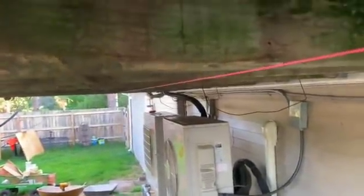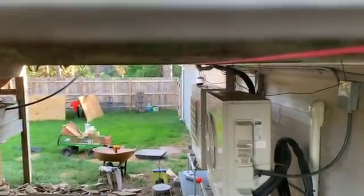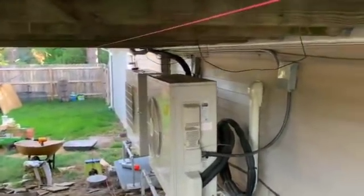It's exactly 32 inches from this string to the house. I stretched the string to see exactly how level the joists are. Starting from the outside - I really didn't want to put a screw hole outside - I stretched the string across and put one of those little balance tools on it to let me know if it's level. As we go across you can see where it's touching the wood.